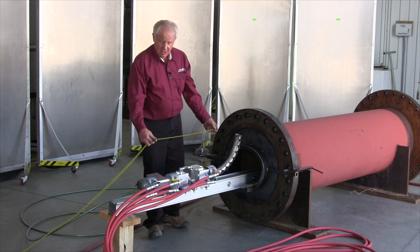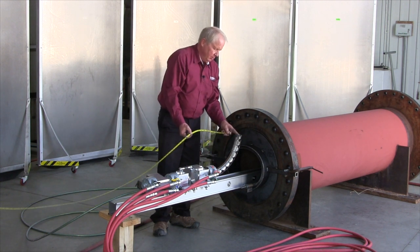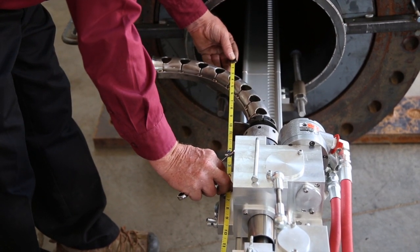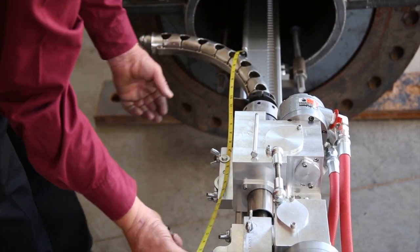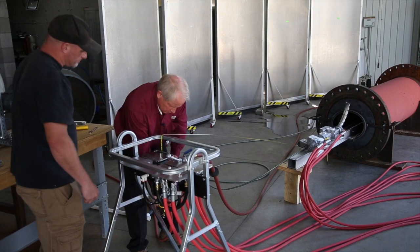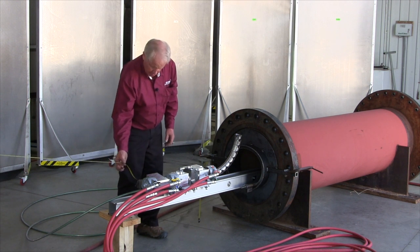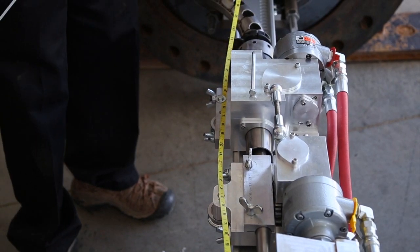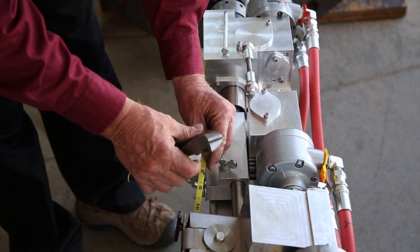I'm now going to attach the tape measure to the train such that the center of the elbow is aligned with the end of the tape — there's a little clamp right here for that. Then I'm going to hang the tape over the control box so that as the machine goes in and out, gravity on the tape reel keeps the tape tight, and you can read the numbers right at the face of the manway. To protect the end of the tape from damage, I'll attach it back to the tape here.